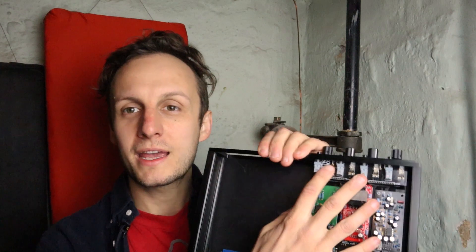That leads us to the second use for earth ground in audio: getting noise out of the system. As a metal box, this is also a decent antenna, so it will pick up electromagnetic interference, radio frequencies — Christian radio especially. For some reason it's very easy to demodulate AM Christian radio. Anyway, that's all noise that could potentially make it into the audio path, because that noise, just like every other electron, just wants to go to the ground. If the audio path is the best way for it to get there, it's going to do that — and that's when you get weird radio stations in your mixes.